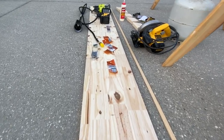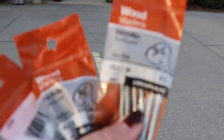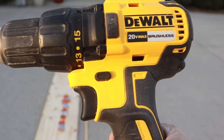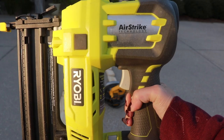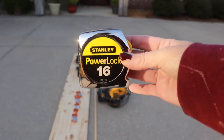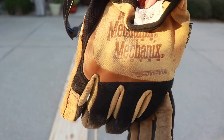First, we used a one inch by 12 inch, eight foot long piece of wood for the base of the shoe rack. Then we used a one inch by one inch piece that was eight feet long for the heel hooks. Then a piece of cord around eight feet long, and two by fours cut into five pieces. Ten number eight two inch wood screws. One circular saw and one drill, cordless preferably. One package of one inch brad nails and a nail gun, cordless preferably. One bottle of Titebond original wood glue. One 16 foot measuring tape. Safety first with safety glasses, respirator and heavy duty gloves.